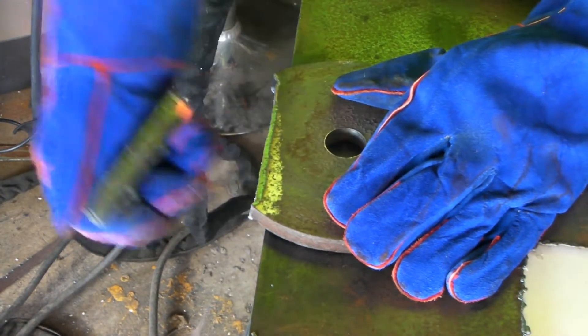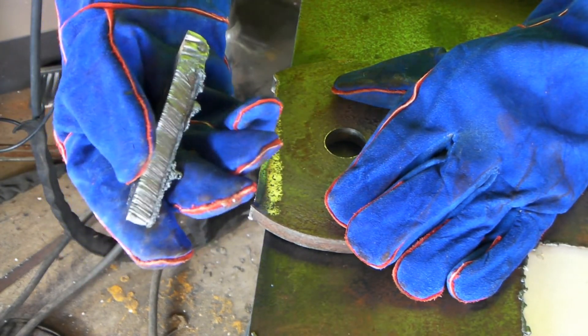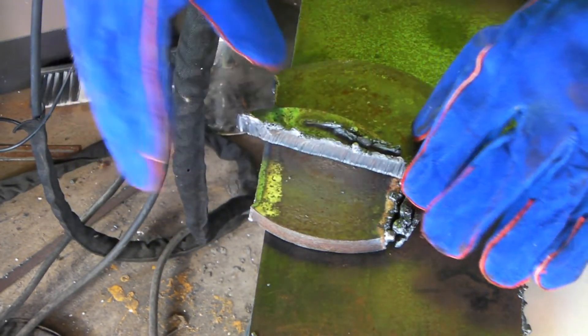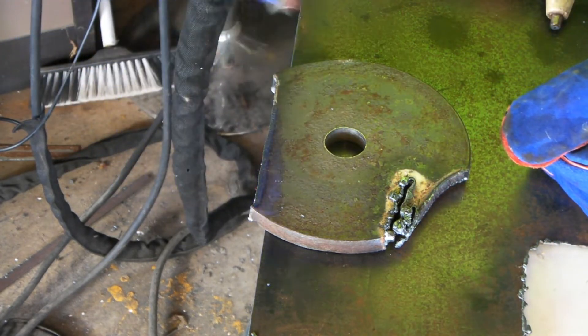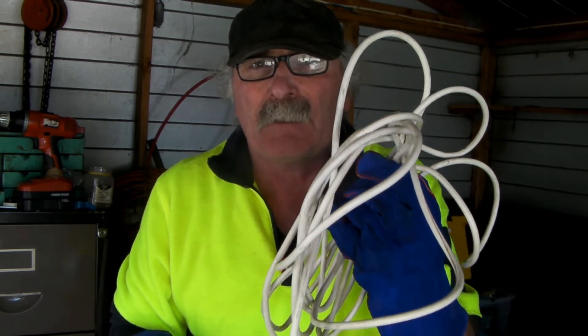So what do we end up with? Look at that — yes sirree! That's on the full power plugged into my circuit, and the other one — that stupid cut there — that's cutting it with an extension cord on a normal circuit. So there you go. Have I learned something today? Well, the first thing I've learned is put your freaking gloves on Pete before you burn your hands. The moral of the story guys is that's not bullshit when they say you've got to have a bigger plug for your plasma cutter — you can't run it on a little domestic power cord like this.